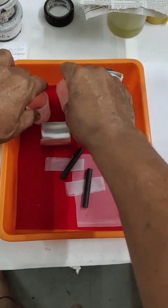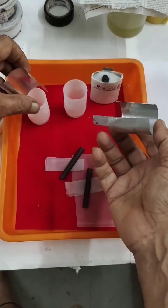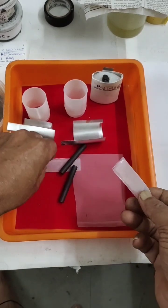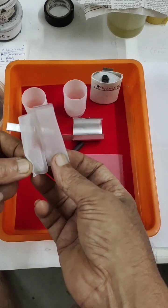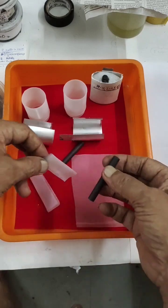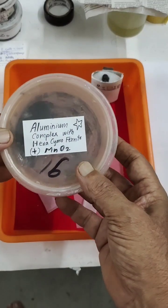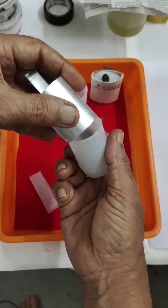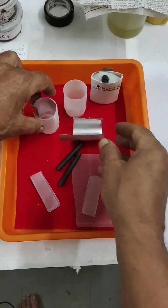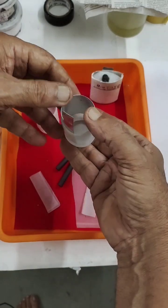I'll club the two cells together in series. For these two cells I need two small bottle containers — I cut them like this. For each container I cut two aluminum pieces, then there is nylon mesh available which I sew into a small narrow bag to accommodate the carbon rod plus the mixture. This aluminum sheet is fixed into the container.